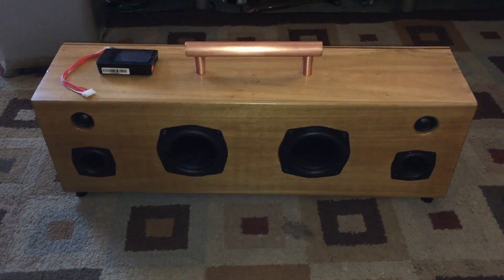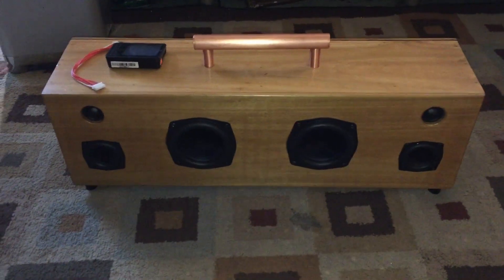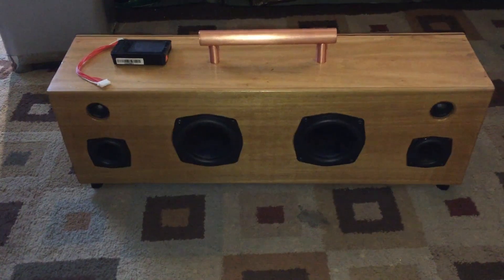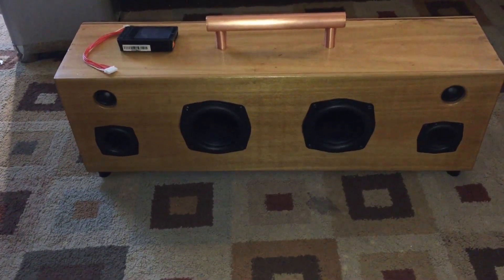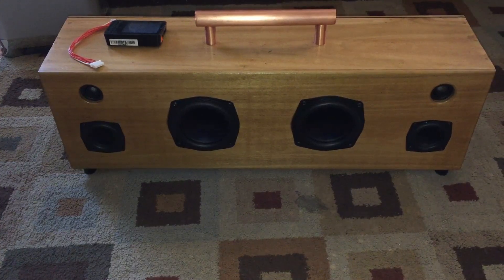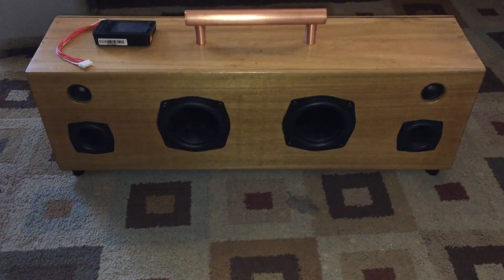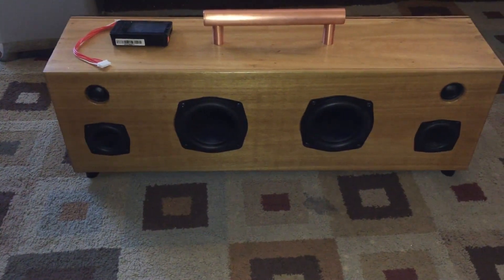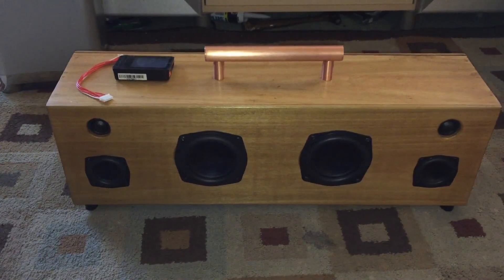It's probably just going to show stages of the build. It's got Dayton Audio drivers all the way in and all the way around it, except I think the tweeters are JBLs. Those are the D105-4s or D105-8s in parallel connection, and that's so I can have 4 ohms. The little ones are in D65-4s.